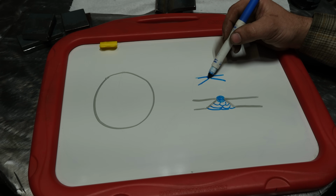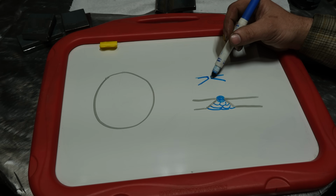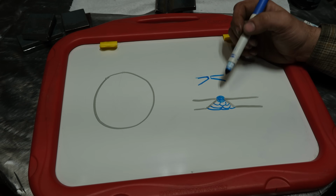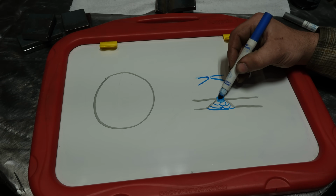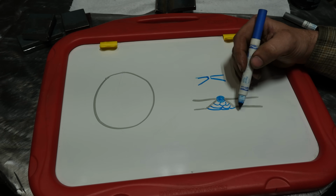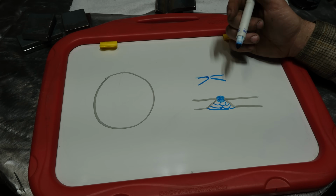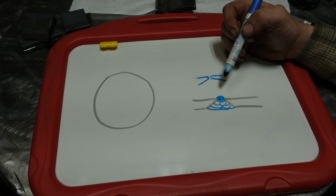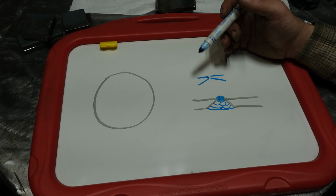More or less, you put a small landing or an edge on that, you square it up about 1/8 inch or 3.2 millimeter. The rest of it is beveled out, and your first root pass is done with 6010, which is this guy right here, and then you fill it out with 7018. That is very common on pipe. Like I said earlier, I'm a certified pipe welder, and that is what I've been doing for over a month straight now, and it works great.